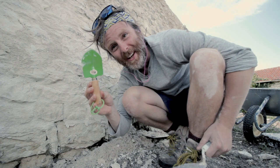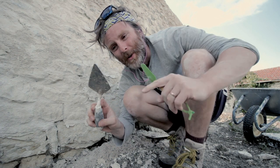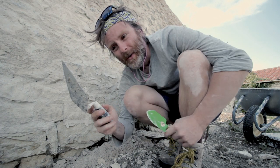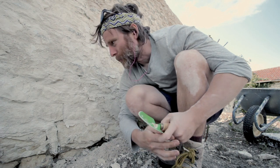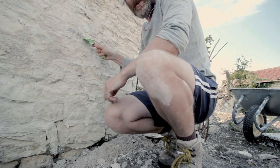Once you've got to this stage and it's getting towards the end of the day and you've filled as much as you can and don't want to make a new mix, scrape away any excess and then get a soft brush and brush between the stones to create a nice effect so it all smooths over with the stones. You can also use a flat-edged tool to scrape away the excess — that's what you'll be doing, just scraping away here.